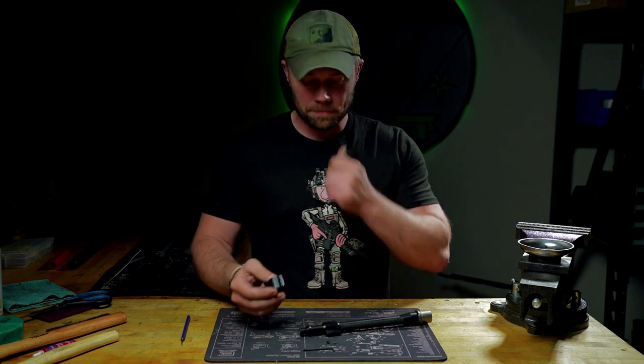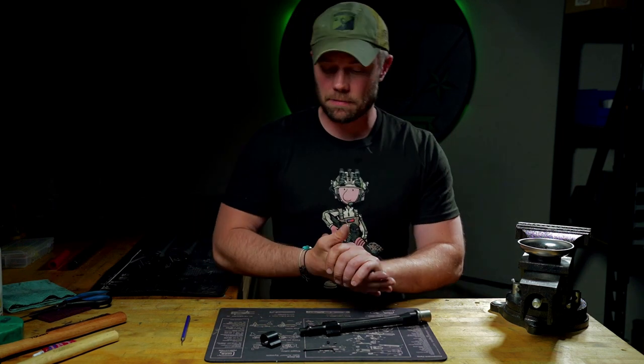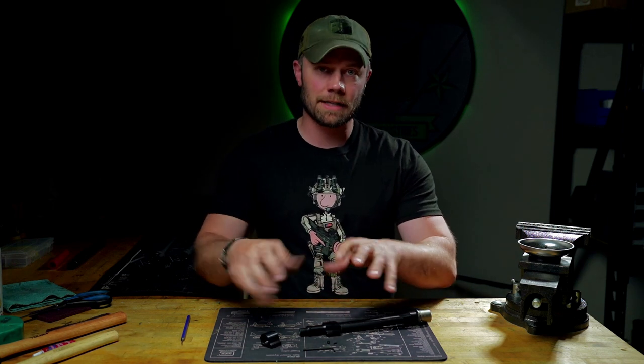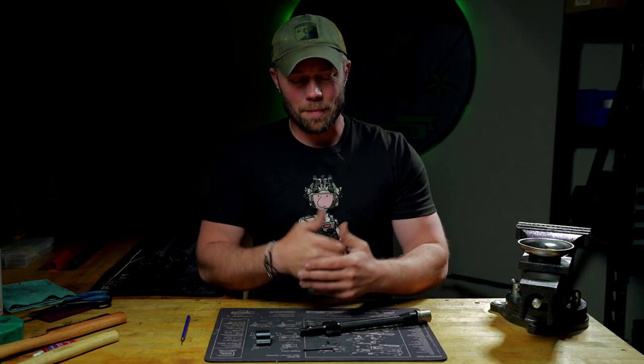One question we've gotten is why we didn't want to pin the gas block to the barrel. If you want to get into it — depending on the type of shooting you're doing, someone focused on close to mid-range with their carbine who wants to pin the gas block probably won't notice any negative effect on accuracy or changes in barrel harmonics from removing that material. But somebody shooting greater distances on the precision side might not want to remove barrel material once it's made. These are low profile gas blocks — they're not front sight bases housing a front sight post on gov profile barrels — so we don't find pinning necessary.